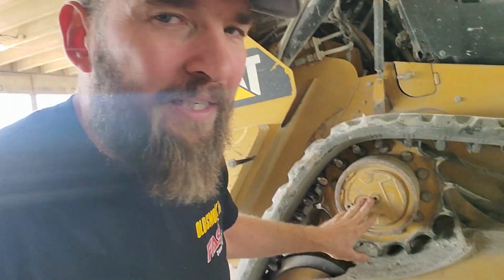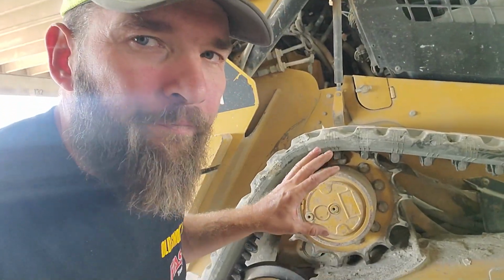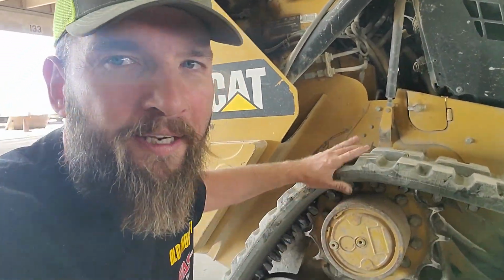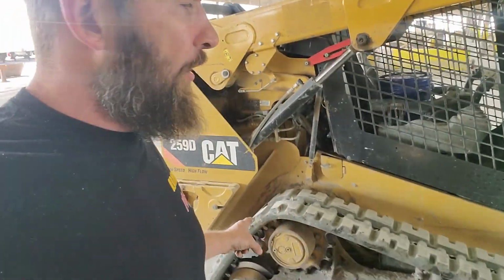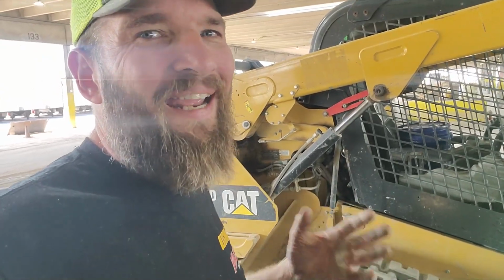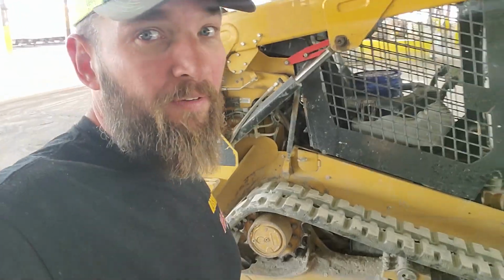It's really not that big of a deal to get into here. You just take the snap ring out, pull that plate off, and then do your planetaries or everything. Now, the owner came by, he told me they had a guy pull that little planetary set out and do some work to it, but it just never quite sounded right after that. So I'm going to go ahead and get this tore down and we'll give it a listen.